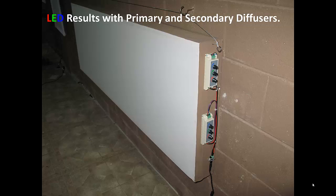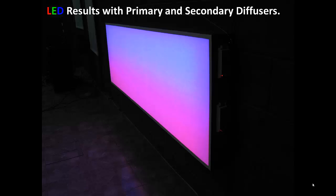DC power jack adapter there that has the 2 wires screw terminaled into it, and it's tie wrapped down so it's strain relieved, and then that plug goes to a 12 volt DC 8 amp power adapter of the brick type, not the wall wart type, but the brick type. Now let's turn the light out and take a look at it.